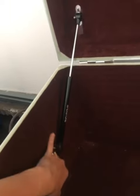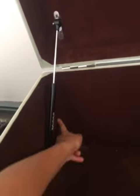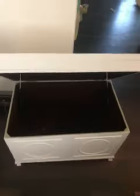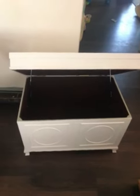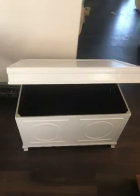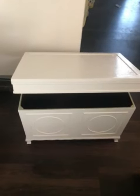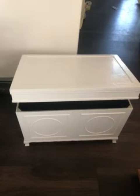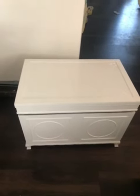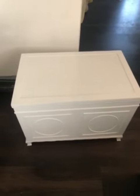For me, this chest is about six and a half inches going this way and five and a half inches going this way, and you can see it really slowly closes. If someone had made this measurement video for me, it would have saved me a lot of heartache. I pre-drilled and tested it out with one screw at a time rather than drilling right away, so I didn't have holes all over the place. It's super sturdy, slowly closes really well, and opens completely all the way — hope this helps.